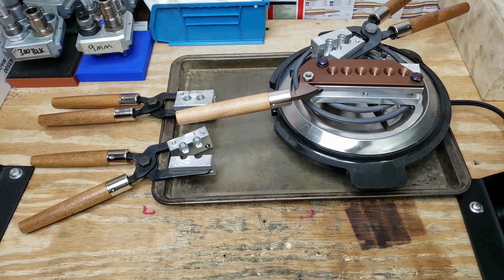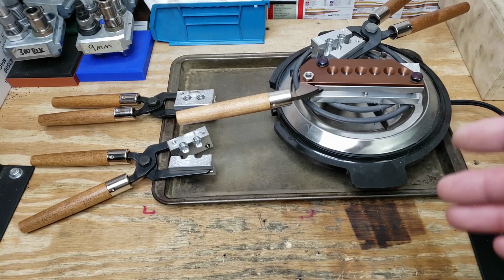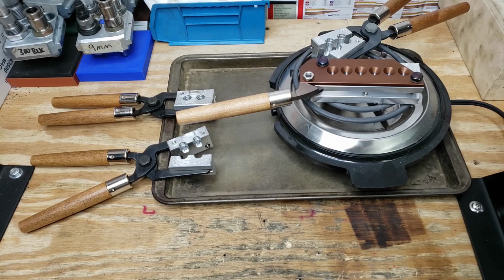Today we're going to be doing a couple of heat cycles on a couple new molds, as well as cleaning them from the factory oils they came with, and doing the same to a couple of molds I've already used a few times just to continue to break them in and smooth everything out. So we're actually starting here at the end of the journey with the heat cycling. This is after everything has been scrubbed clean with a dish detergent grease remover, and now we're heat cycling it to break it in as if you've cast with it for a few sessions already.